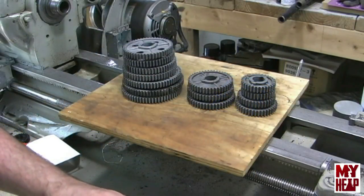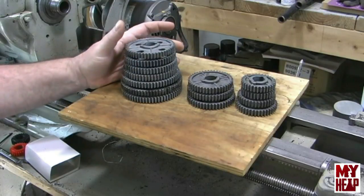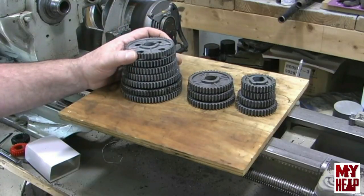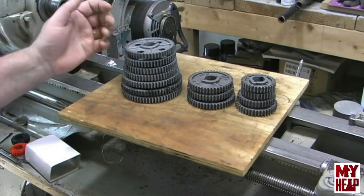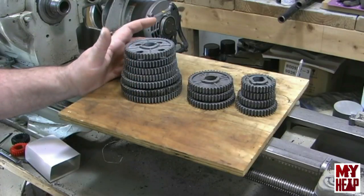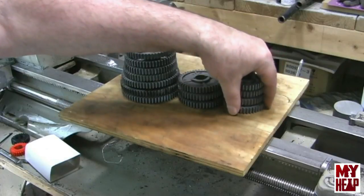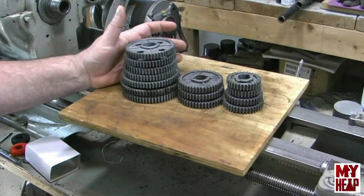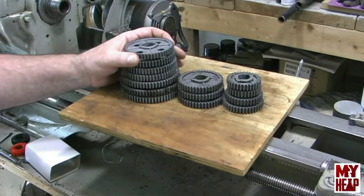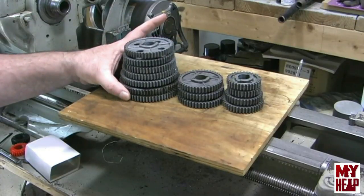As some of my subscribers know, when I got this lathe they had no back gears other than what was on the end of the machine — something to set up maybe 16 threads per inch. Jeremy was kind enough to send me a couple of gears so I can turn a decent feed rate. I did stumble across a deal on our favorite auction site and now I have all of the change gears for the lathe plus a couple of extra — a 50 and a 60 — which are kind of odd gears not included in the set, but they'd probably expand what kind of thread or feed I could set up.